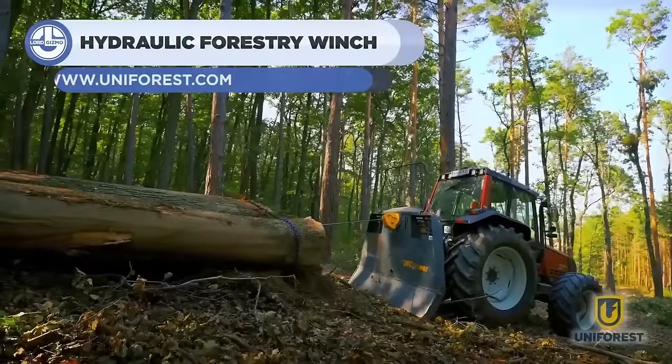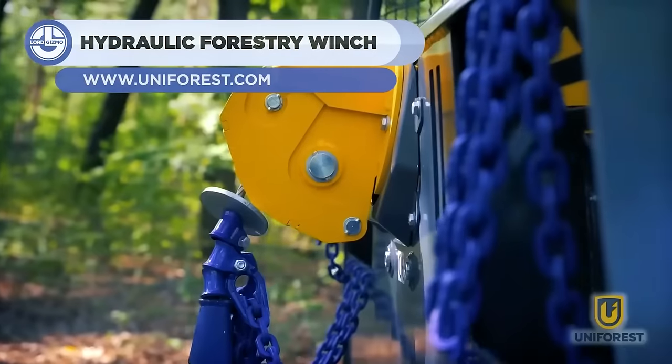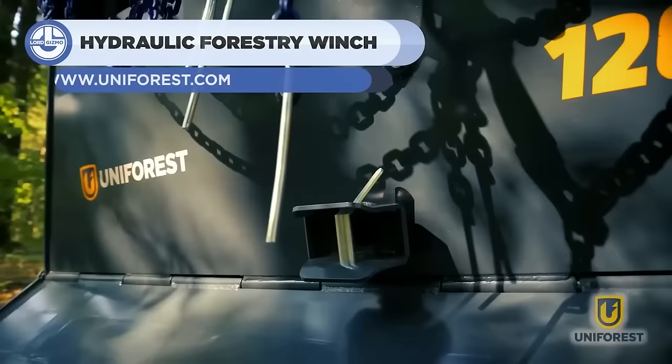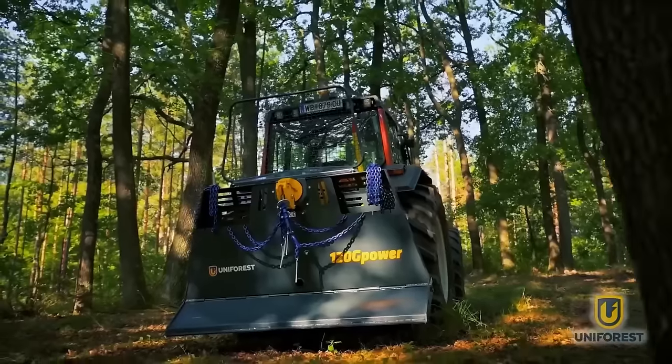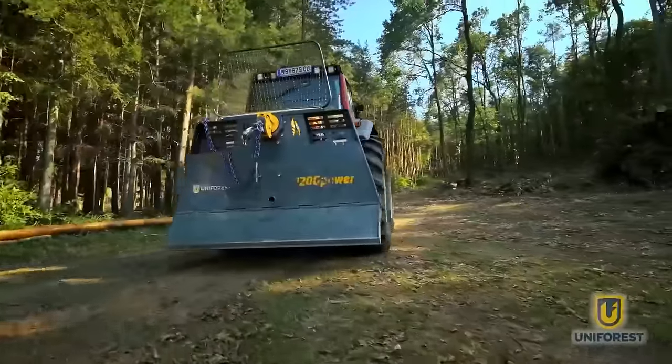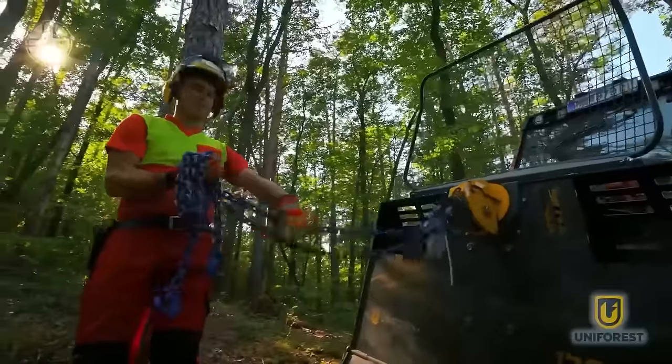The Forestry Winch 120G Power with a pulling force of 12 tons is the most extensive and robust in its category. The winch is mounted closer to the tractor, and the pulley is fixed lower, which lowers the center of gravity of the winch. There is little risk of lifting the tractor.